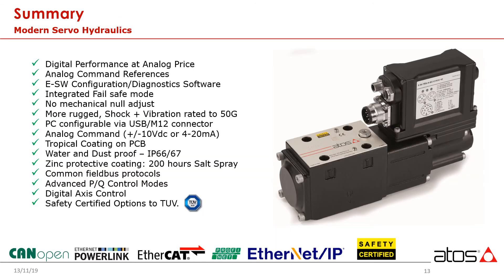In summary, modern electro-hydraulic systems should be designed using high-performance digital technology. Classic servos still have their place in certain applications where operating at frequencies over 60 Hz is still required. However, the large majority of industrial applications will be well below this threshold. Digital servo solenoid valves are applied successfully today in a huge range of markets and applications.